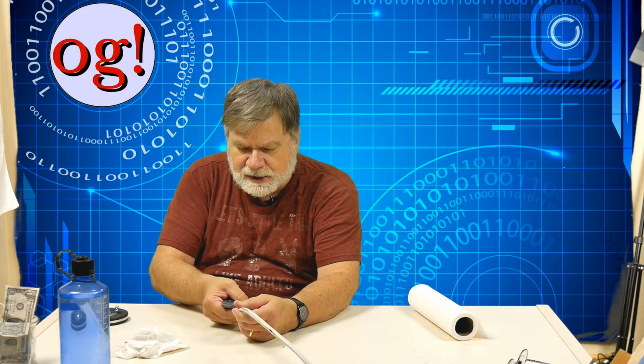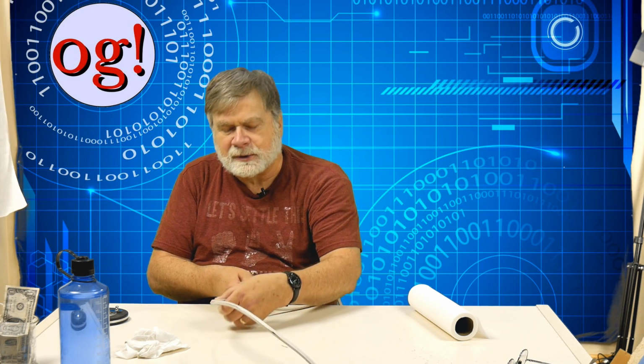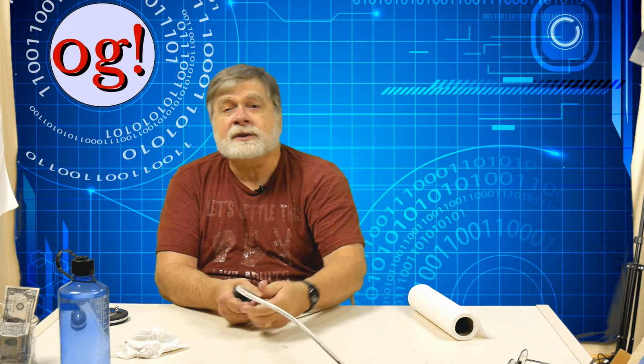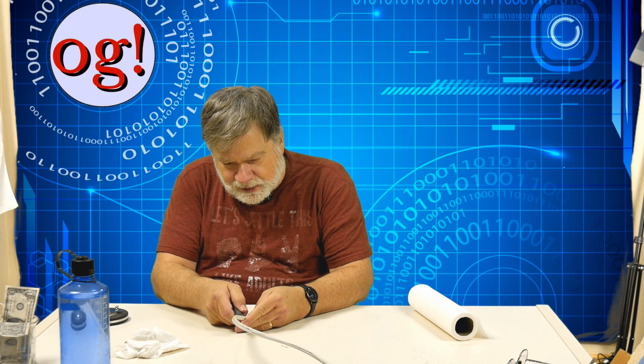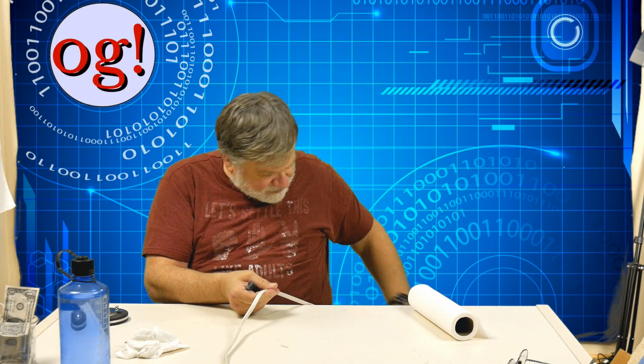We're going to put an insulator in the middle, and we're going to feed it with coax without a balun. Just feed it with coax, because that's the most common way it's done. If we run into problems, then we will add a balun. So let's just see what we can do without all the fun of having to run baluns and that sort of thing.